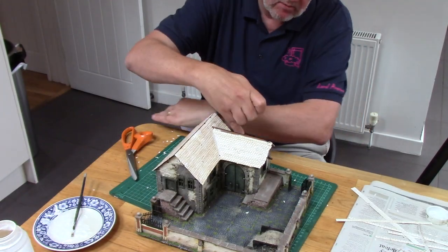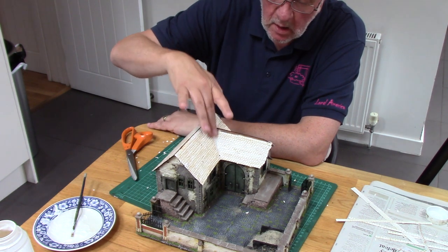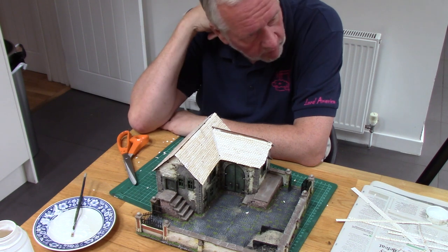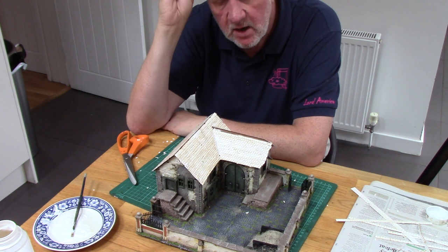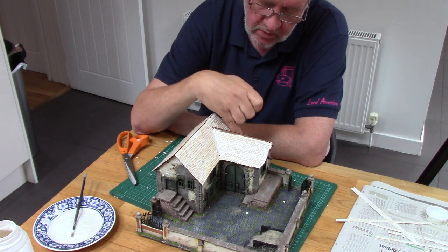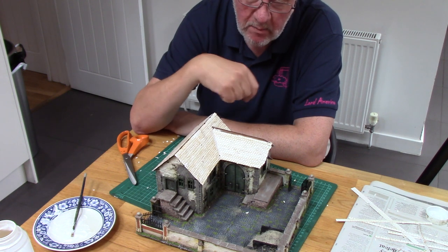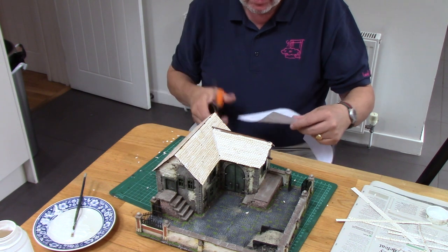You'll see now is that you've got some areas here where the two roofs meet, which ordinarily in real life a roof there would have what's called flashing. Traditionally it was lead. You do get lead substitutes now, but basically this is soft metal which is run in there and then gently hammered in with a mallet, so it seals up and it becomes waterproof.